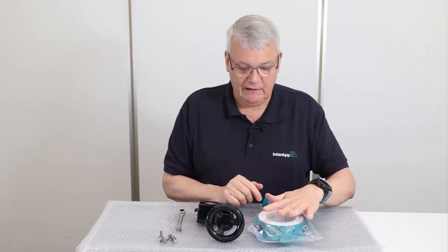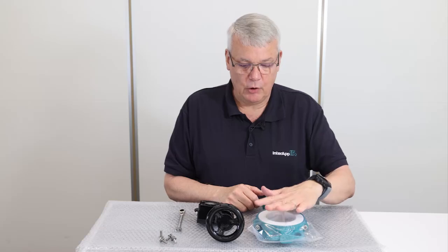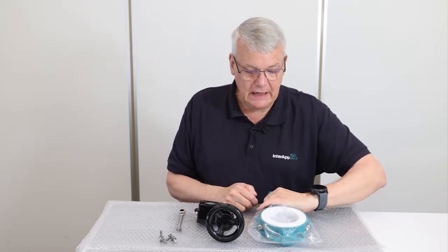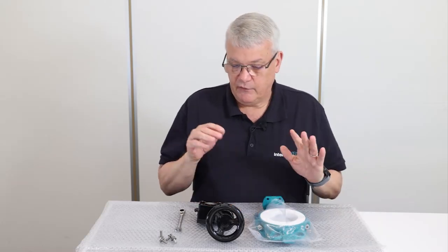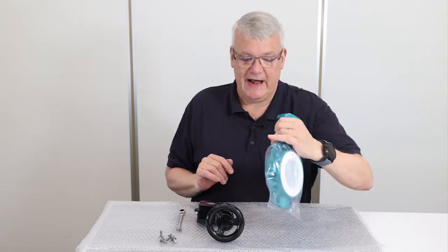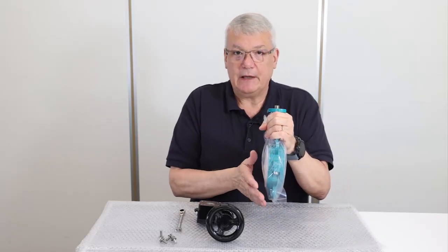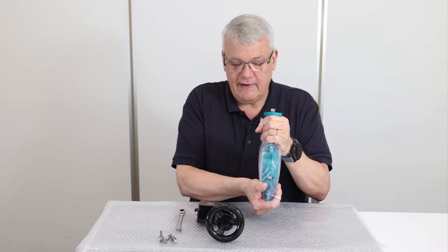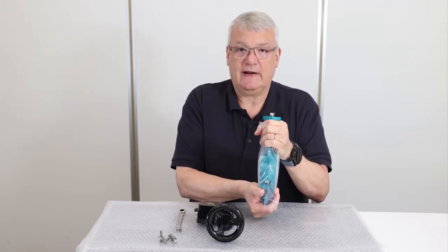The valve is delivered in a pocket and you should not remove that plastic bag — keep it always in the plastic bag. Furthermore, I don't use a vise. I will not clamp the valve in the vise because the liner of the Bianca is very fragile, and if I use the vise the wrong way I will damage the valve.